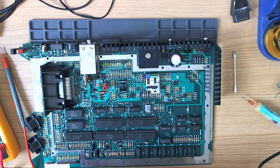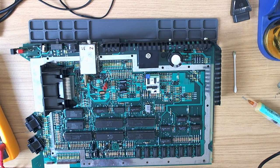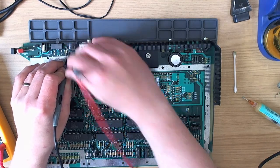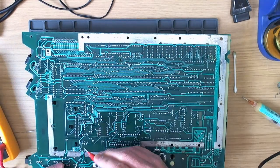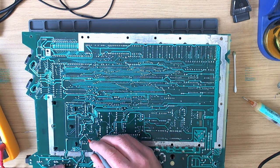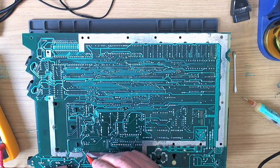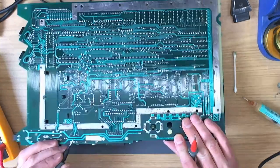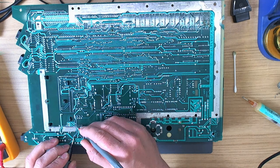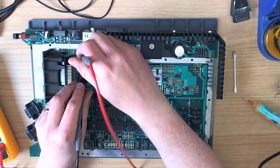Absolutely right. So composite video and luminance are on the left hand side. Luma is on the outside pin, and I'm assuming this is going to end up somewhere down here, on the left hand side. To disconnect that completely, we've got a captive ground on the luminance, which I guess can come off. And then it goes round here and down to this middle coil. So we'll lift.